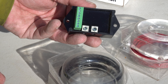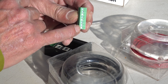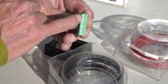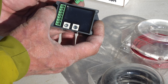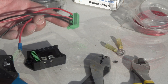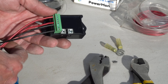The way we are going to wire the Thornwave Power Mon for our use, we are only going to need to connect four wires, and this unplugs to make things really easy to work with. We are going to be connecting the ground to Terminal 1, the external shunt to Terminals 4 and 5, and the positive lead to the battery to power the monitor to Terminal 8. Terminal 7, by the way, is for monitoring a second power bank — so yes, this Power Mon can actually monitor two power banks. We've finished manufacturing our own little wiring harness with the appropriate wires and ring terminals. Just plug that in and go hook it up.